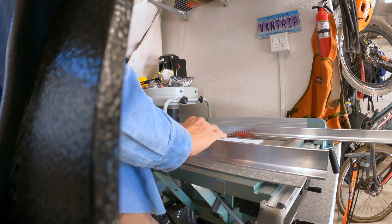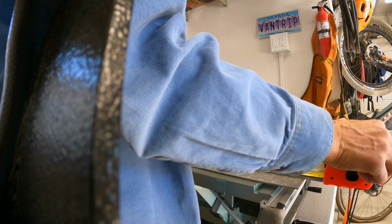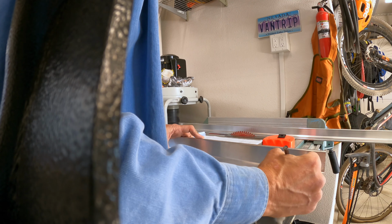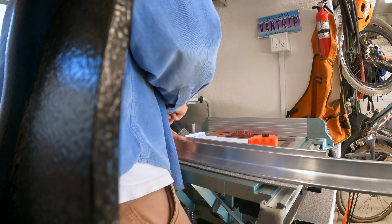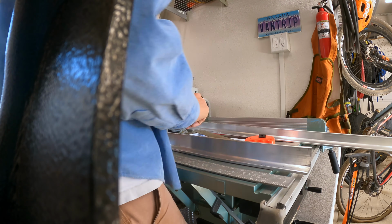So I get on with designing out and building my skid plate, and basically what this is made up of is a bunch of 1/4 inch angle aluminum brackets that attach to the frame in multiple places and have some kickers going out at 45 or some other angles to available attachment points on the chassis frame to ensure that it's braced and supported in multiple directions.